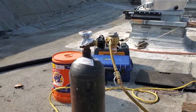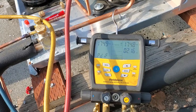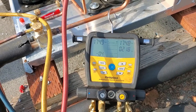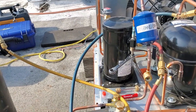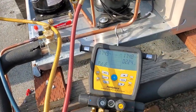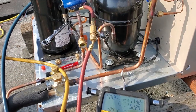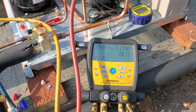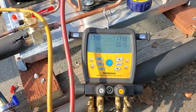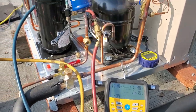We've got a nitrogen pressure test going on right here. We're going to give it a few minutes — I really don't anticipate any leaks. I'm an impatient person. I can't wait any longer. We dropped 0.4 PSI, so I'm cool with it. We're going to go get the vacuum pump running.